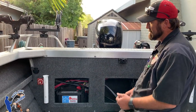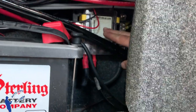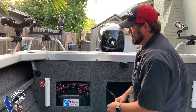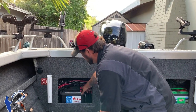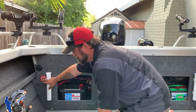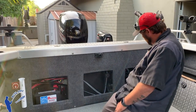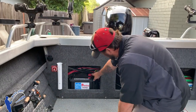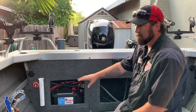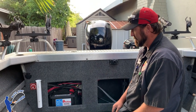The way you want to wire this up: run everything on the boat to a main fuse or main power lug, then off of that run everything to the common post on the switch. From position one on the switch, run a wire to battery one, your crank battery. From position two on the switch, run a wire to battery two, your house battery. Then run a shared ground from both batteries to a common ground lug that all your grounds share. That way, anything on the boat will work from battery one, battery two, or both combined.